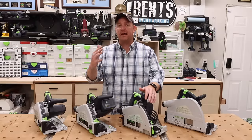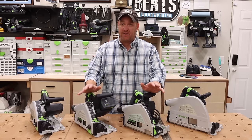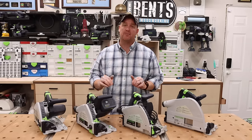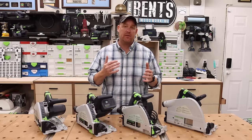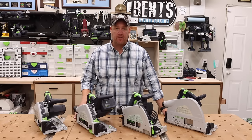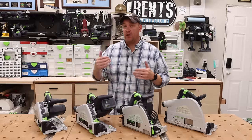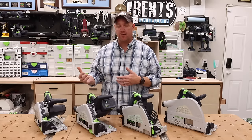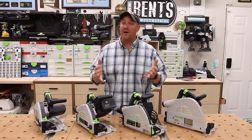I think I've covered the main similarities and differences between the four options Festool offers. Because I'm asked so often which one is right for most people, I want to close by sharing my thoughts. A lot of people fall into the trap of 'better to have it and not need it than need it and not have it,' but with power tools that's not always true. If you're only cutting material that's an inch and a half thick or less, you do not need a TS75. If you're cutting two-plus-inch thick material all the time — making waterfall tables or needing to cut bevels in thicker material — a TS55 or TSC55 is not the right tool. It really boils down to what you do normally.